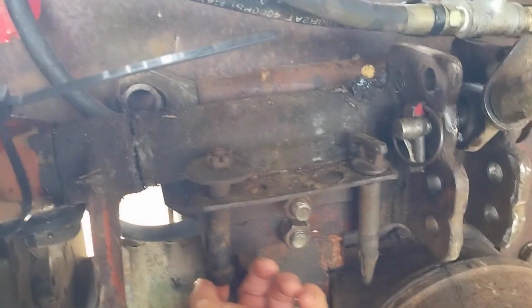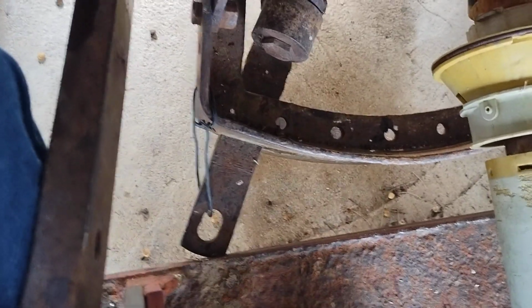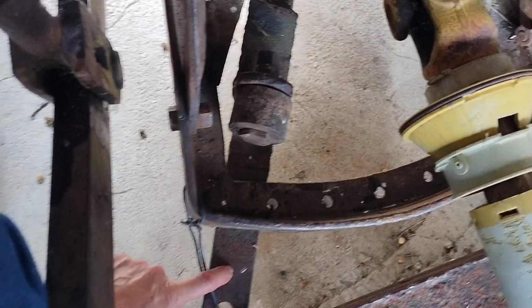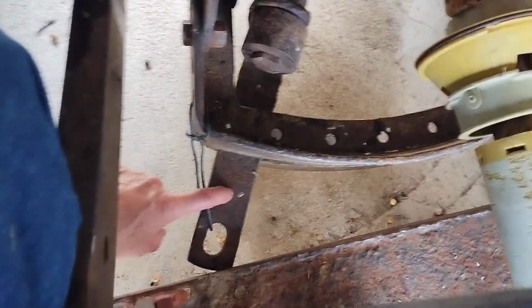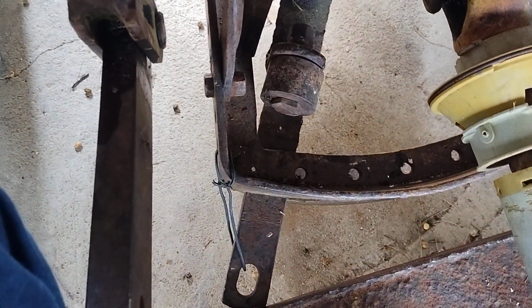It's a nice little rack for the hitch pins for the center link here, like on this shredder. And this is actually the pull pin for the drawbar that I had to slide forwards and tie over out of the way because it's a little too long. I'm hoping to take and drill a 1/2 inch pilot hole in it and then a 3/4 inch hole in it further up here, and then cut this off with a grinder in the near future,